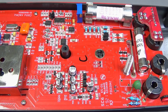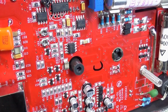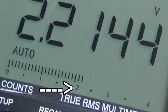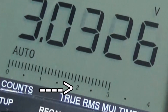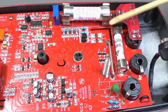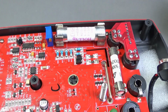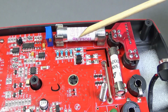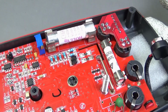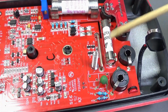So far, this is my product review. I like the multimeter, that's the reason I wanted it. It has many things we will see later in other videos about it. Defects, yes, the 2 is on the right side of the bar on the screen, and this is not a defect, but probably I have to reconsider the fuses myself. After everybody complains about the ceramic ones missing 1000 volts, I should consider fuses, probably fast blow but for 250 volts. That's for my case, as I told you guys, is something that you have to customize to your needs. In the same way, you have to customize this for your needs too.